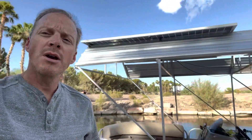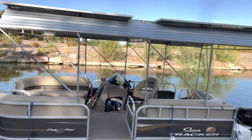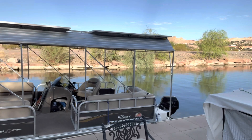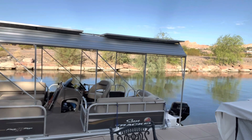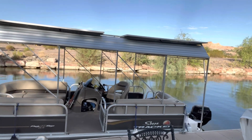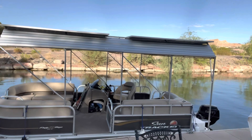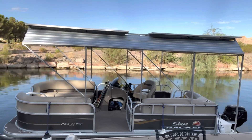Welcome to Net Positive. Today I will be showcasing the pure solar-powered pontoon boat. In a previous video on this channel I showed the building of this boat — this is a conversion project utilizing a 60-horsepower Yamaha outboard converted to electric, 35,000 watts, and the canopy whose main purpose was for shade but will be double-servicing as a solar canopy.